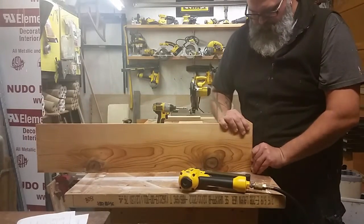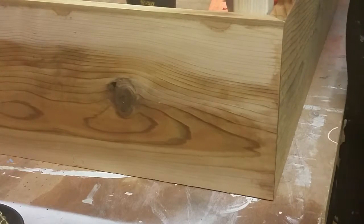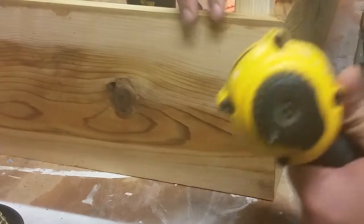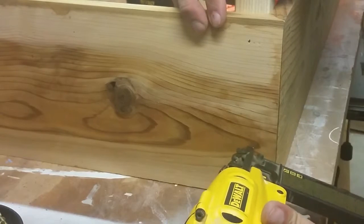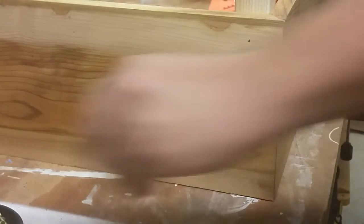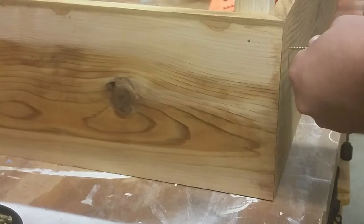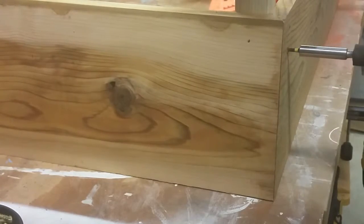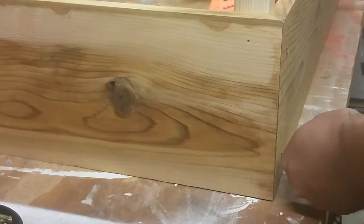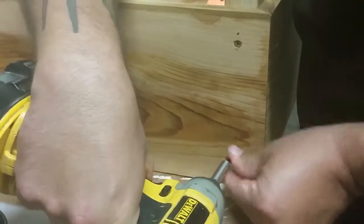Next, I am cutting six 2x2s at 15 inches in length. A 1x8 board is 7.5 inches, stacked on top of each other equals 15. You'll see here the miter corners make a really nice look on the corners. I'm simply tacking in place with 1.25 inch brads just so I can place my decking screws in. That's going to hold all the weight. I chose not to use glue because I'm treating this like you would if you were to build a fence. You don't use any glue for building a fence. So I'm going to try this without glue and see what happens.